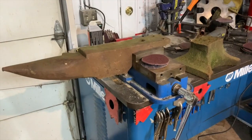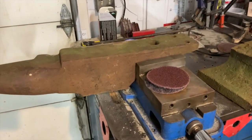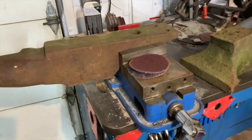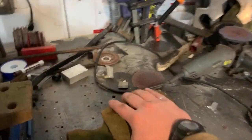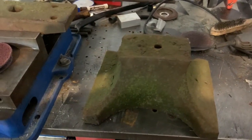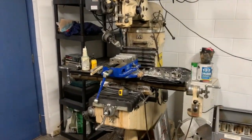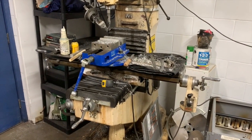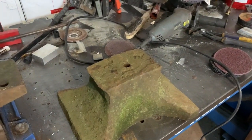I don't see too much as far as the pattern. Okay YouTube, change of plans — I just figured out this quick-tach base for the anvil. No, I'm just kidding, but this will be how I hold it down. The base is flat enough but has a little rock, so I might spin it around, figure out where the high points are, and try to get it flattened. When I'm all done I might throw the anvil on the mill and take a plane at the top, or use a surfacing wheel. For now we're just going to start polishing, get it welded, and then do the cosmetic stuff afterwards.